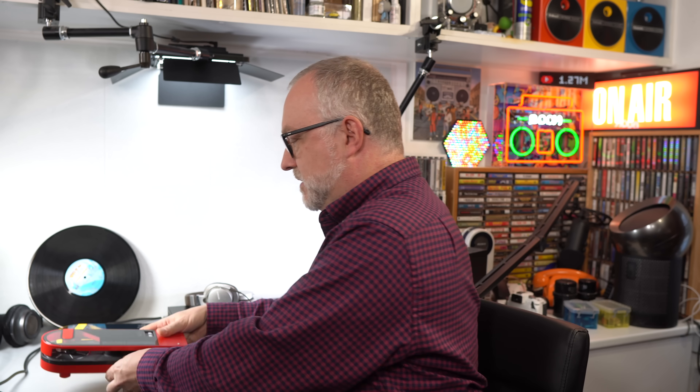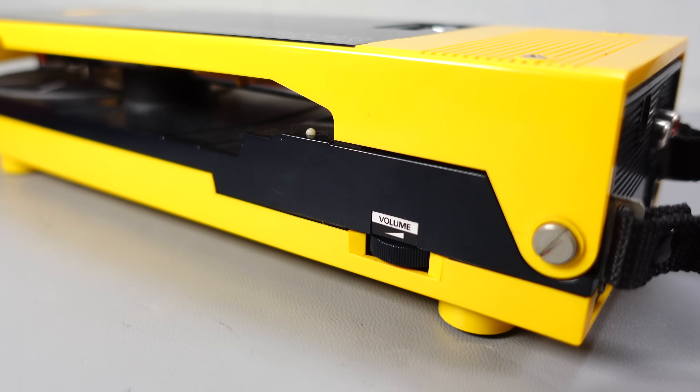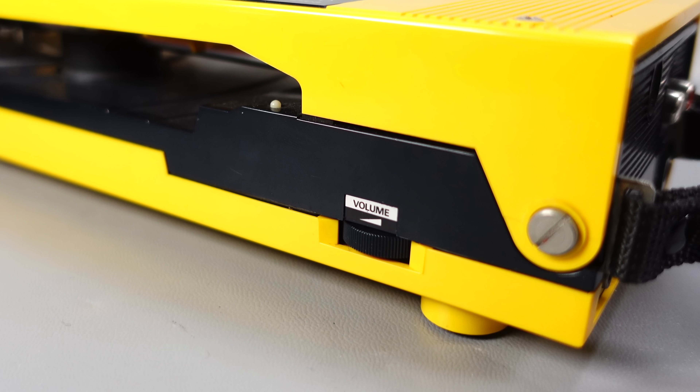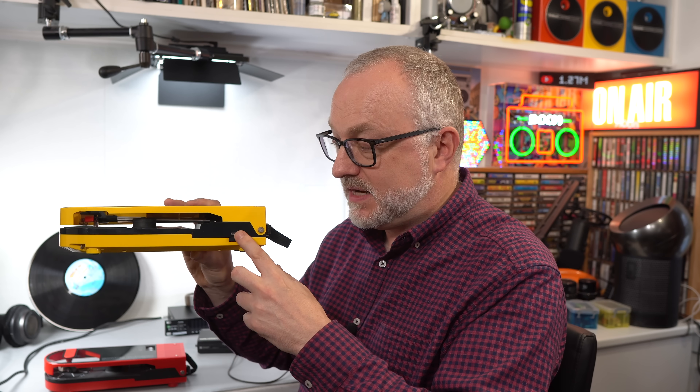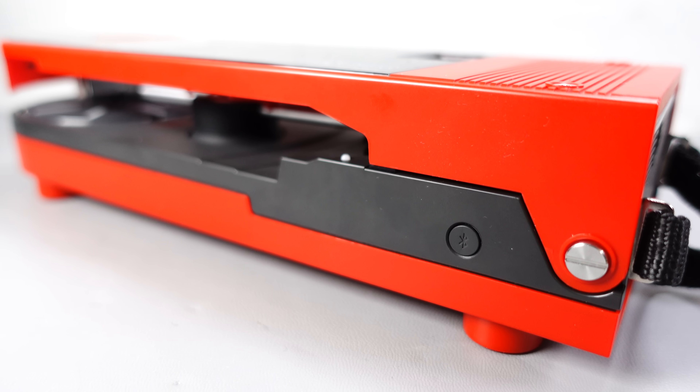What you need to do is look at the label printed next to the socket to see what it's supposed to do. You look and it says 'headphones' — plug your headphones in there. On this one it says 'line out,' not 'headphones.' Even without the label, it's clear this device isn't designed for headphones because something's missing that was on the original: the original has a volume control wheel, because there's a headphone amplifier inside it.